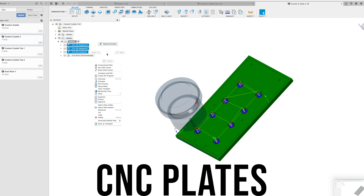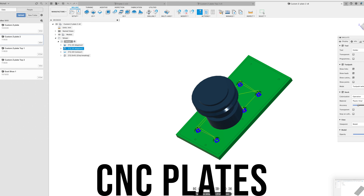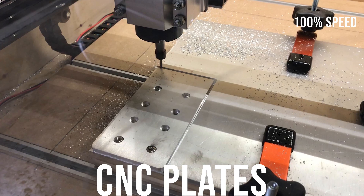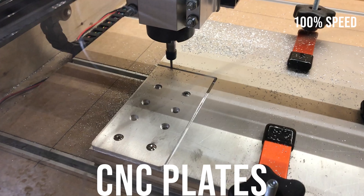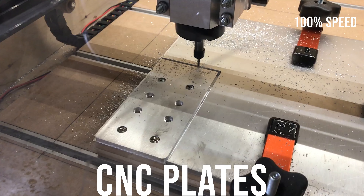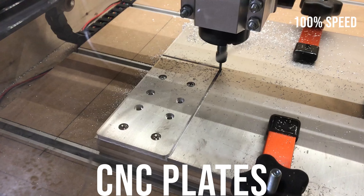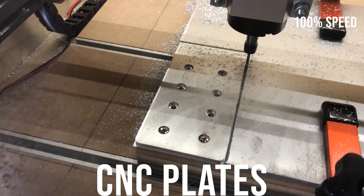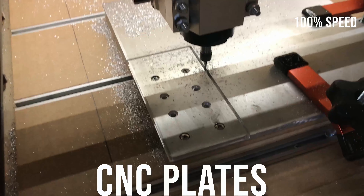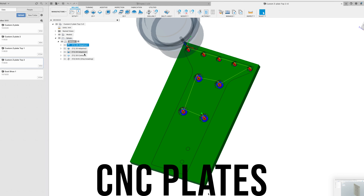This project was for another CNC machine I had at the time called the WorkBee. I was trying to add some rigidity to the aluminum extrusions by adding linear rails, and I needed to create a couple of aluminum plates to mount the Z-axis to the new rails. I was using quarter-inch aluminum plate and I wasn't sure how the Carveking was going to handle it, but I took conservative cuts and it cut all the plates out great. I cut out all the holes first so I could put screws through them to hold the piece down — that way I didn't have to use tabs. I was able to just cut the whole perimeter out, and here's the second part I needed to cut out.